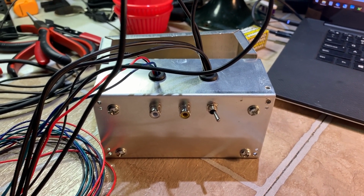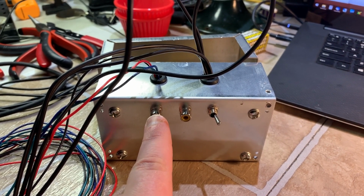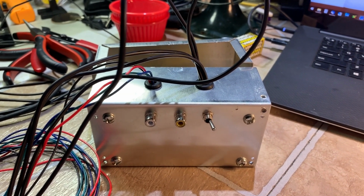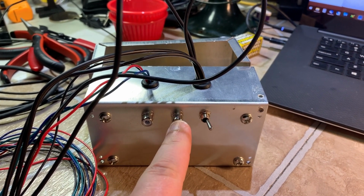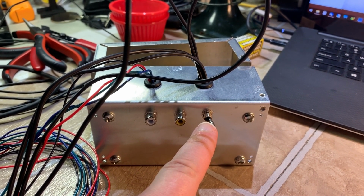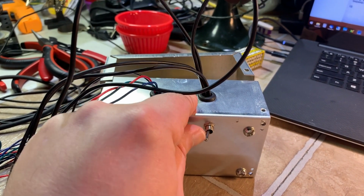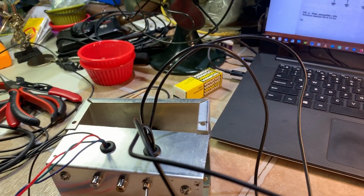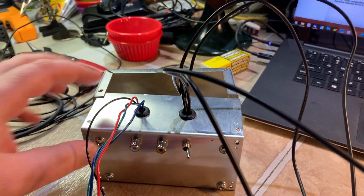And what's happening here is the audio doesn't need anything done to it, so it'll just hook directly into the volume control and go through for preamplification, then final amplification from there. I will show that on the schematic in just a second. The video input, of course, in this position gets fed from the IF stages, and then back through it, just the pass-through. Flip here, and it goes through that circuit. So that's why there's 4 wires here. There's a set for video, and a set for audio. Over here, you've got 4 wires.